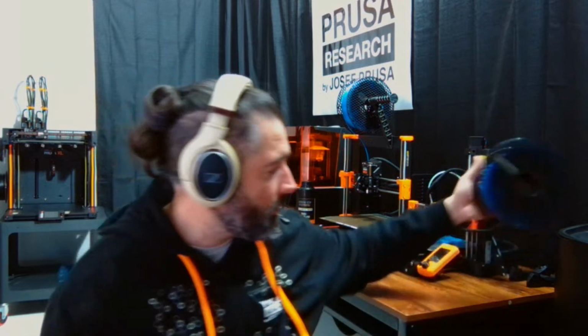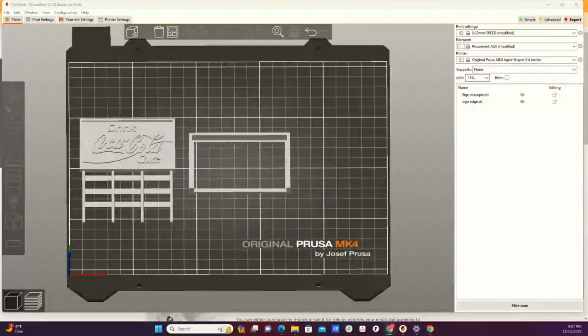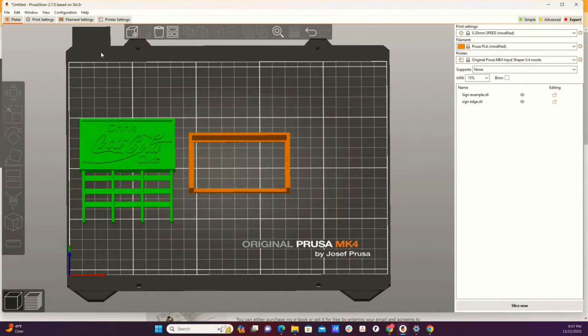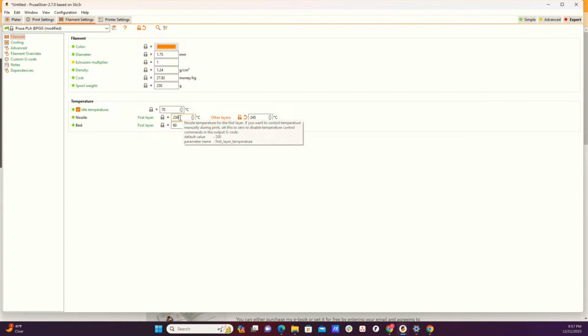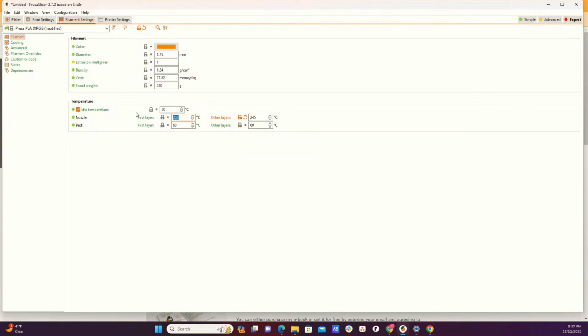So you'll plug those numbers from the filament into your slicer. If I'm using PLA, which is what that was, I come here to PLA, and then I'll just verify in my filament settings. I think I told it to transfer, but it said 215 plus or minus 10, and then 50 plus or minus 10. So maybe I want the first layer to be a little bit hotter and then drop this down to 50 or 55. And some of it is so minuscule, it doesn't change. You have some variation. It doesn't have to be exactly 60 degrees Celsius, right?